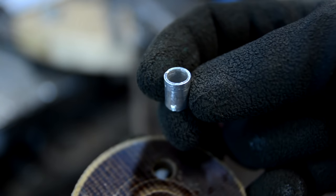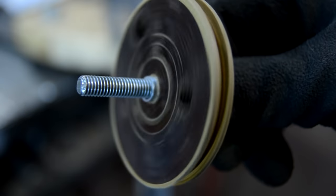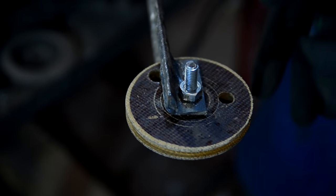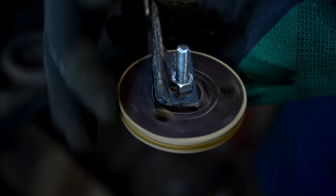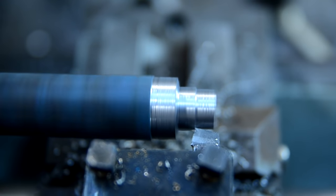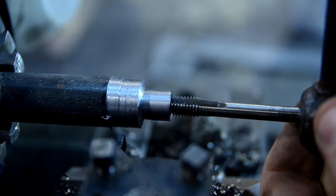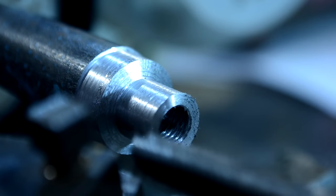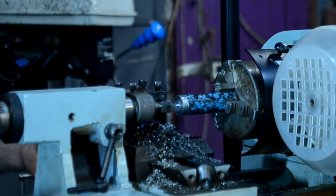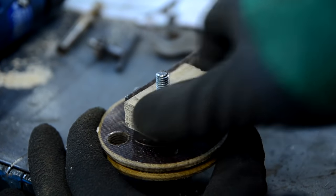I inserted an aluminum plug into the block for the best sliding of the block on the axis. The plug should be a little wider than the block so the arms couldn't clip it during the pin travel. On the end of the pin there would be metal cap screws to which the bowstring would be bound. I prepared these parts on the lathe too. They would be fastened on a pin through a wooden spacer.